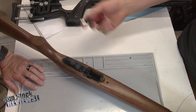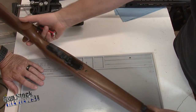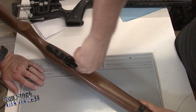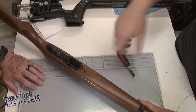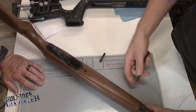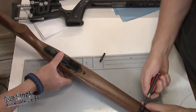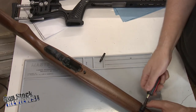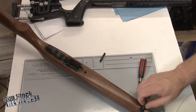What you would do is, after you disassemble the stock screw and the barrel band — there's a barrel band up here — I want to do the barrel band first. My screwdrivers are a little too small or too big, so I'll just pull this screw out. This thing kind of floats in here; you don't need to take it all the way out. Let me change my screwdriver tips. We'll just pull off that front barrel band. I remember when those bands used to be metal — now they are polymer, and they do break.